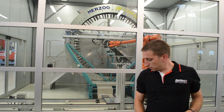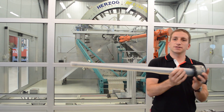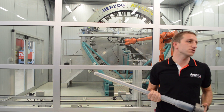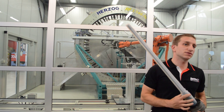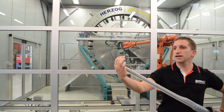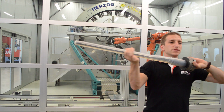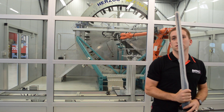It's quite hard — first you go in this direction, and then you need to make sure that once you pull back, you don't pull the fibers. This was very challenging for us, but it's all in the details of the process. Once we go for the third layer, we turn the whole mandrel and restart. This is to make sure the fibers are very tight on the mandrel.